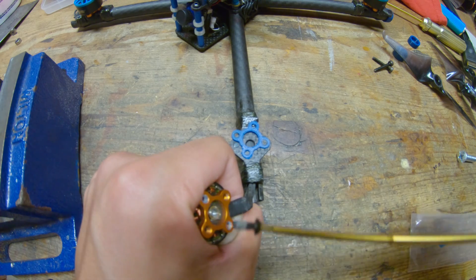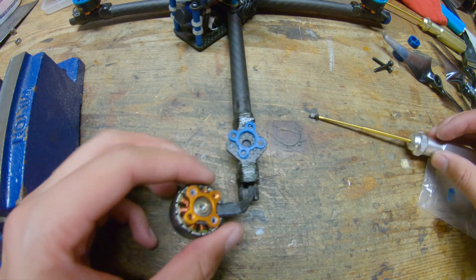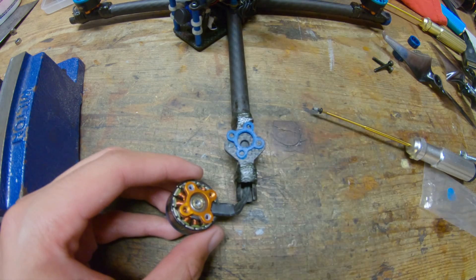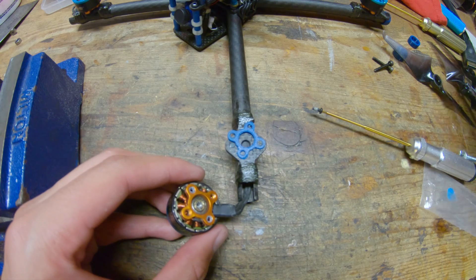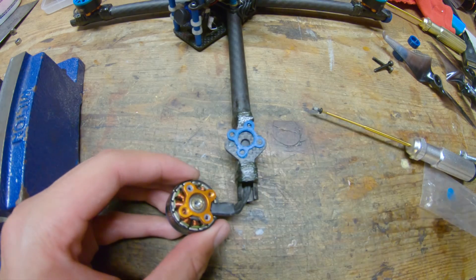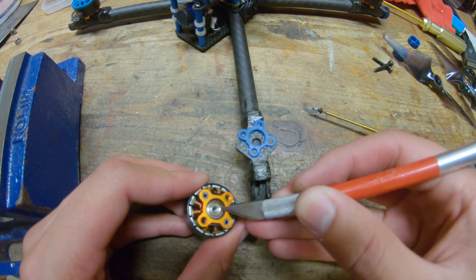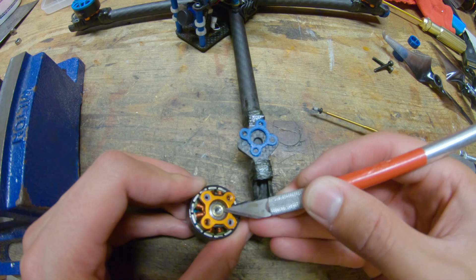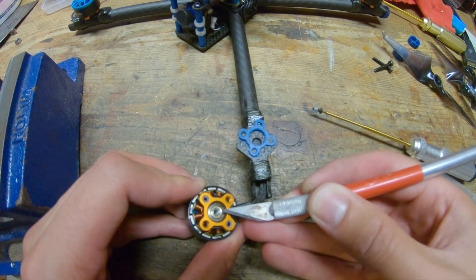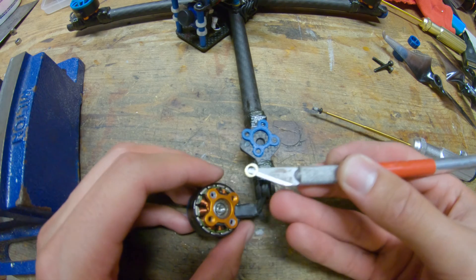You can see all that thread locker on that screw. And now usually you'll have a spacer in here that you want to take out and not lose. It is worth mentioning that some motors don't have the retaining screw — they'll just have like a C clip or an E clip, and you just have to kind of pry that off.